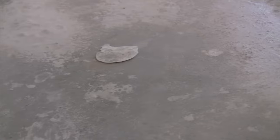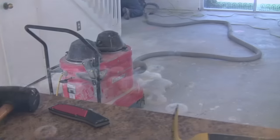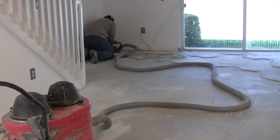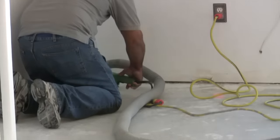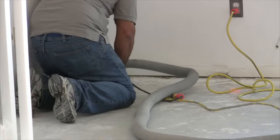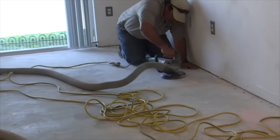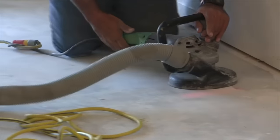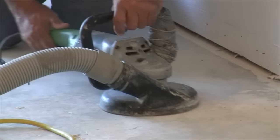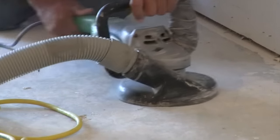With a room this size it really does take a few people to pull this off because of the timing. The material they use is a fast-setting self-leveler, so they have to prep the floor first. Here you can see what the worker is doing — he's using a diamond grinder on his angle grinder, going around the floor, chiseling down and grinding down all of the high points to make the surface somewhat smooth but rough and textured.